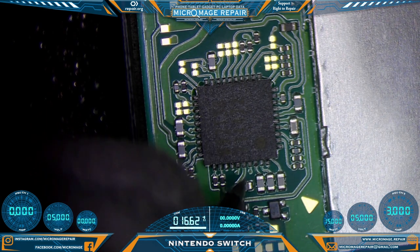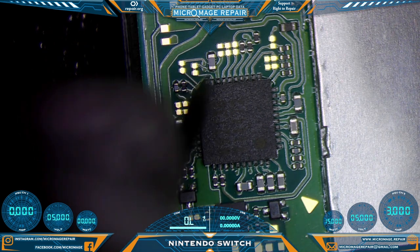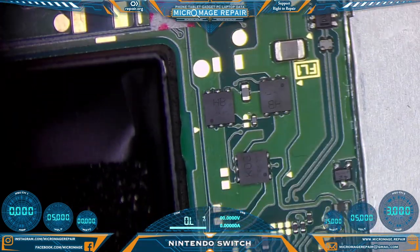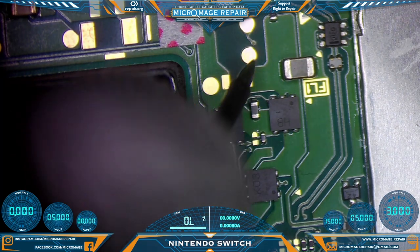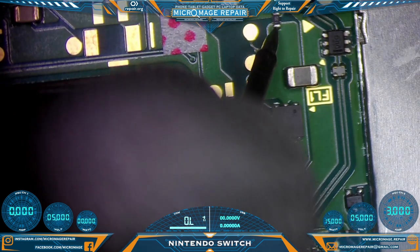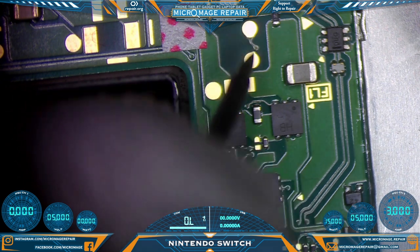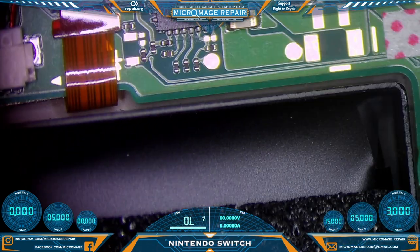Let's check our other ones. That's shorted. That's shorted. We have quite a blown-up M92-T36 here. At least the CPU cap seems to be okay. Let's move up to our MOSFETs area and make sure we don't have anything going on there. Check our invincible fuse — it is still being invincible. Let's check our test pads. None of these in the middle here should have a short to ground, and we've got shorts to ground. All sorts of things shorted going on on this one.